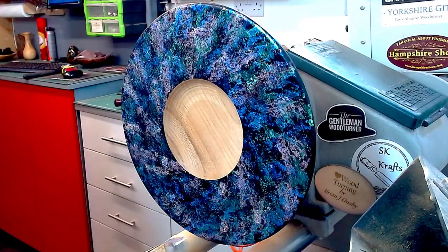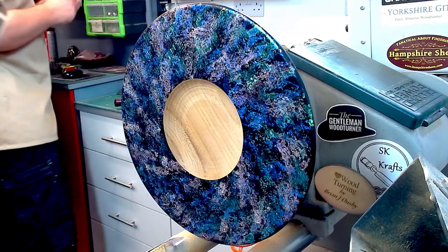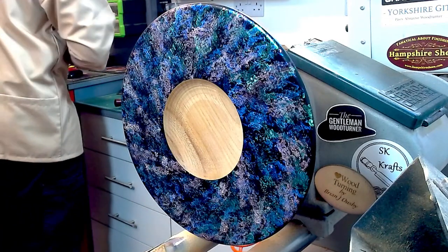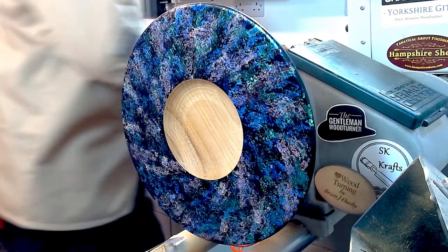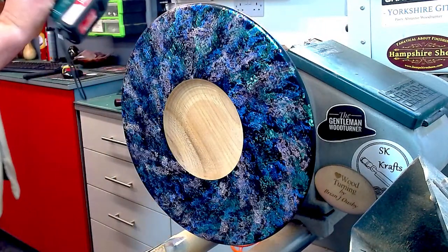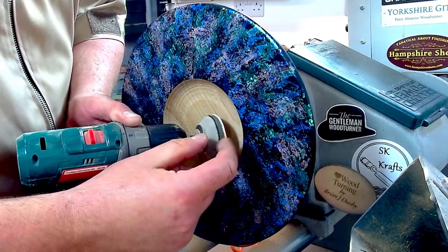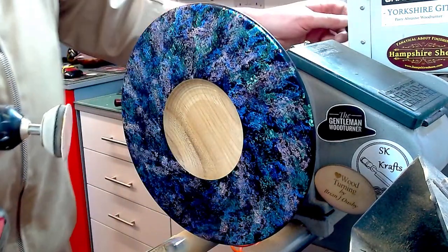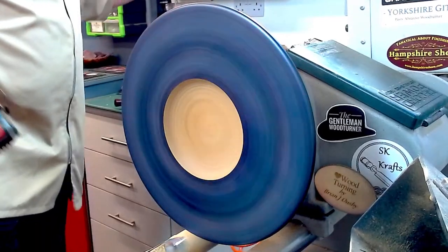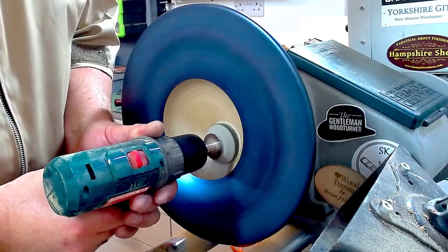All right, so let's polish that up. So I'm going to sand that with a drill. I want to try and keep that tight edge. So the way to keep the tight edge is when you're bringing your drill back, only have this part of the disc rub on the edge there. If you come past, you're going to curve it. So, extraction on. Careful. Speed up. Alexa, extractor on.